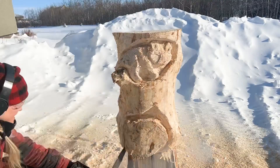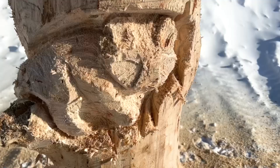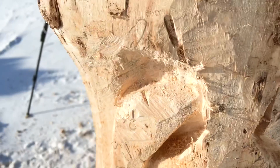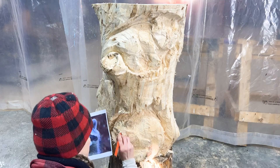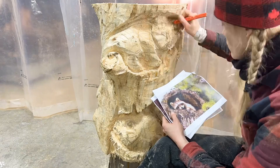Negative space means the space around the object that I want removed — in this case, the hole into the log around the raccoon. When the rough outline is carved and negative space has been removed, I cut off gradual wedges from the edges of the raccoons to help round out their shape. This style of carving is essentially called a relief carving, which means selectively cutting into the surface and removing material, leaving the unsculpted parts appear raised or 3D in appearance without carving the entire object in the full round. Another common term for this is surface carving.